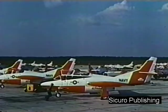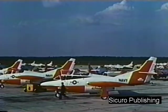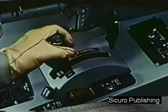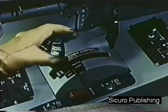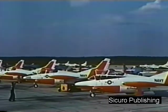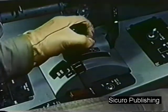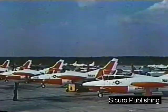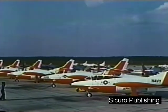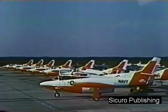Hold the brakes and give the plane captain the pull chock signal. Adjust the friction on the power control lever. After the plane captain is clear of the aircraft and gives you the turn up hold signal, advance power to 60% RPM. Release the brakes on signal and allow forward speed to build up for the turn before reducing power to idle. Be cautious of directing jet blast on the line.